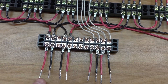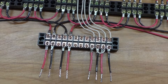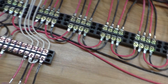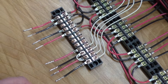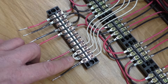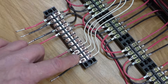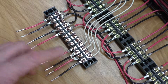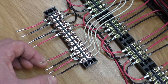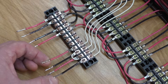These other two ends are the other ends of the coil. I've wound these secondaries so that there are two coils, and I've got a small jumper across here joining both secondary windings together. I'm using this lead here and this lead here to measure the voltage and waveform coming off the secondary coil.